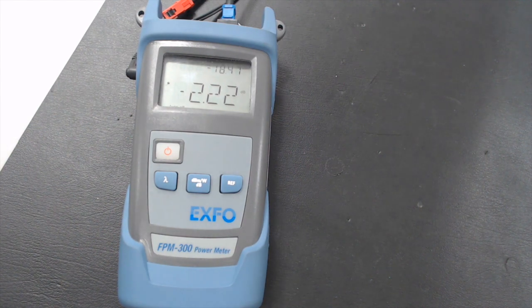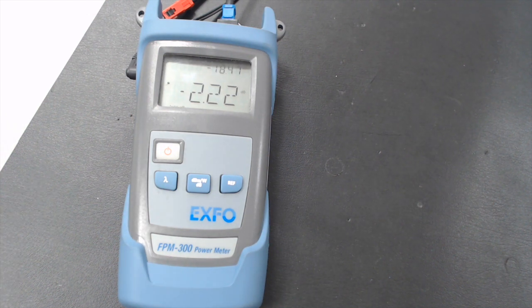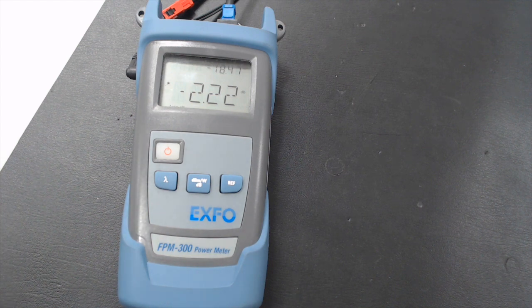When you're using an optical loss test set, the important thing to remember is after you set your referencing, you can disconnect the fiber from the meter — the power meter — but you cannot disconnect the fiber from the source. Because you've set the reference, the whole test system is told that the patch cords plus the meter are part of the system — that's what is expected. Ultimately you want as short a patch cord as possible so it doesn't affect your tests, but this in essence is an optical loss test set.